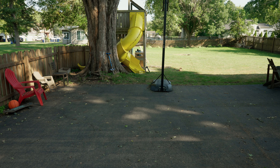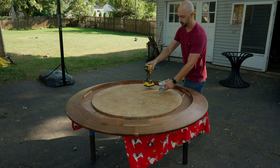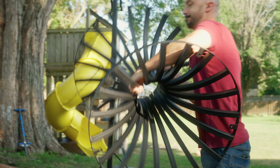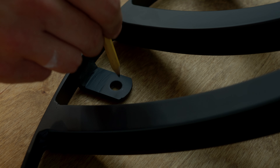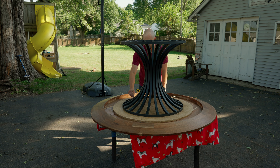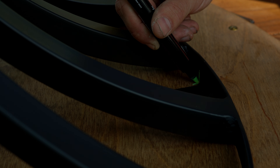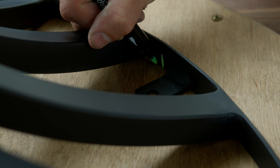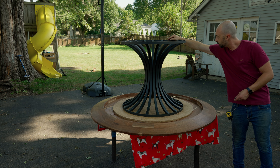After slapping on a few coats of lacquer, I moved on to adding threaded inserts that were actually going to hold the pedestal bases to the tops themselves. I placed the tabletops on a separate table with a blanket under them so they wouldn't get scratched up, marked the spots where I wanted to drill out the holes, and used a super bright green highlighter to make marks so I could align the bases to the proper position. Looking back on this build, I absolutely love how it turned out.